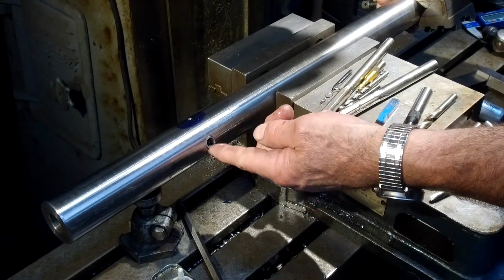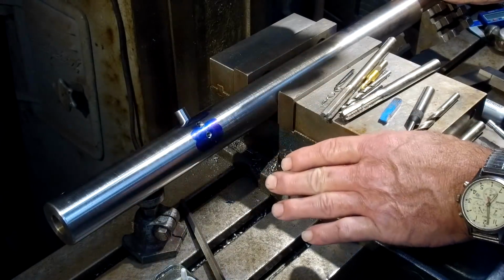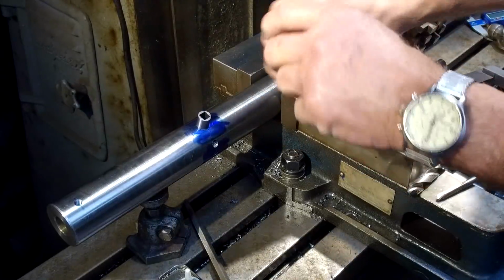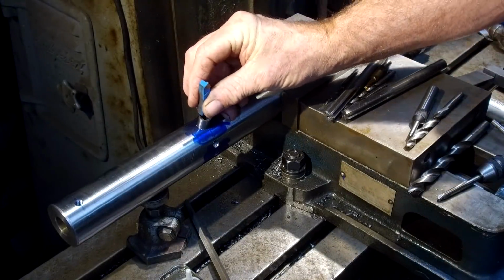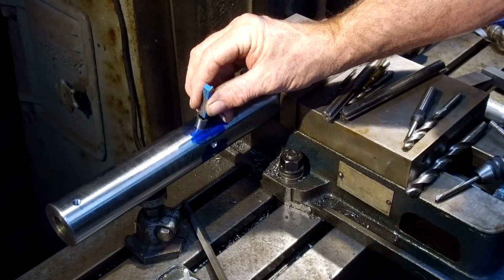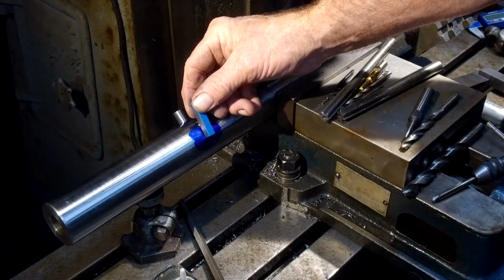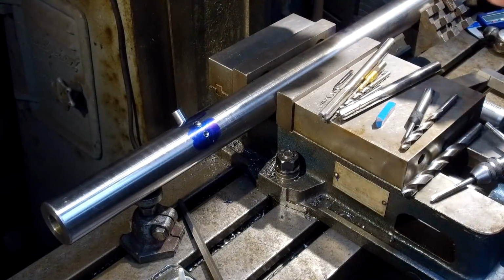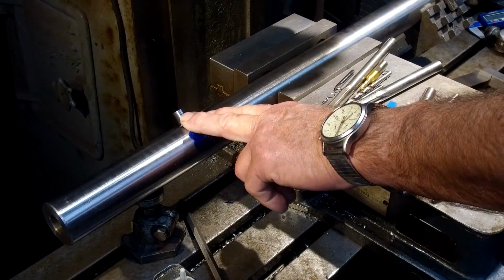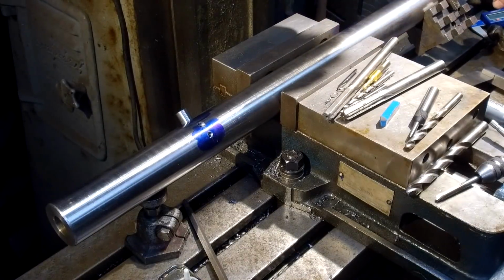And of course this is sticking out. We've got some corners here, some burrs there, and this is sticking out here. We're going to dress all that off afterwards, but we're setting it in so that we're square with the tool bit. We don't want any twisting action this way or that way. It's got to be square, it's got to be leading the center line, and it's got to have the set screws pushing in the preferred place. That's what I'm going to show you on my next one. We're only going to be putting 3 on this bar. This will do number 1 and 2, and we'll have 3 and 4, and then 5 and 6 on this one here.